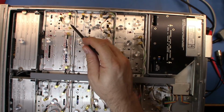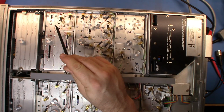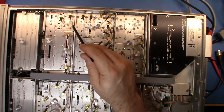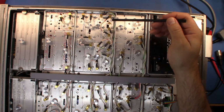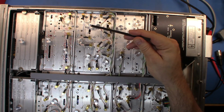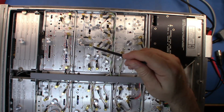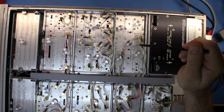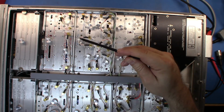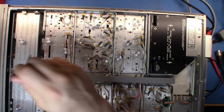And so over here we've got our modulation drive unit, and this is where we're going to do our FM modulation. There's some phase detection, and we're going to be able to do all of the looping on that. I'd have to go have a look. I don't know exactly whether these are involved in the ALC or in the modulation stuff. We also got a bunch of modulation control in here, so this is probably the modulation control circuitry in there.